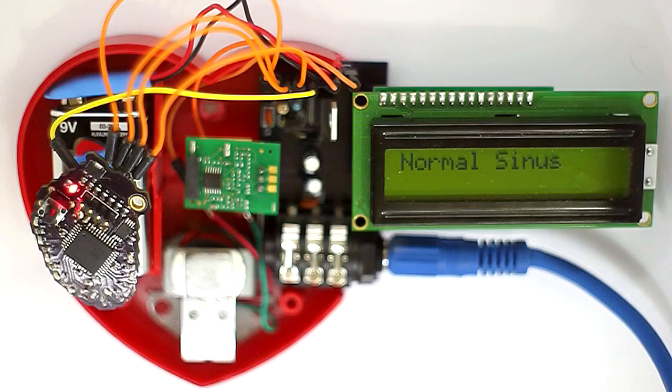The LCD is a 16x2 LCD module from Parallax. The audio can be heard with headphones off a quarter-inch jack, which is what we're recording through for you to hear. The pulse generator is a solenoid valve from an old 80s teddy bear toy known as the Heart-to-Heart Bear. The Polar rate receiver has a spot to sit and get heartbeat information from the wearer of the transmitter. This board is powered by a 9-volt battery.